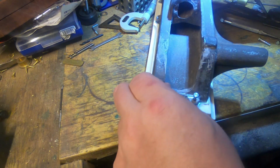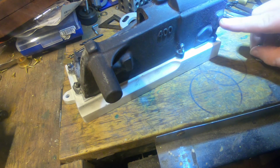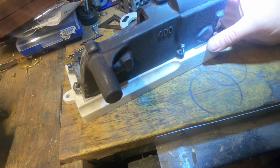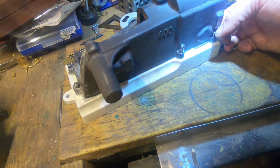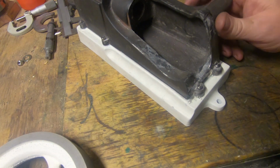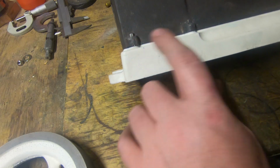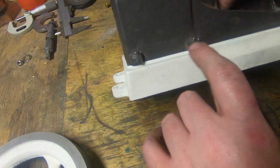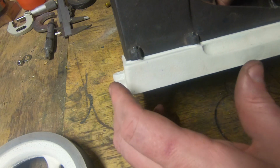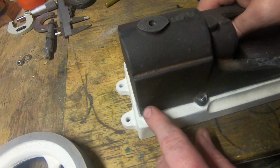So let's do these up and have a bit of a look at what's next. One of these is a short bolt because this is in the way here, and that will be machined off, and then I don't think it'll be so much of a problem. But until then, we're going to live with a short bolt in here. So I've cleared the bench off a bit, and we've got these in somewhere near. These 2 here are nice and neat, and they sit down really sweet. I think they probably want washers on them, and probably they're going to get high nuts and studs, which is more in keeping of what it probably should have. I think that might be a decision that I'm going to make and put studs in there.